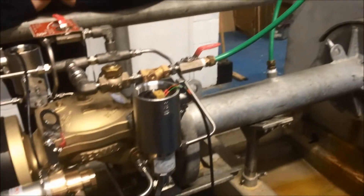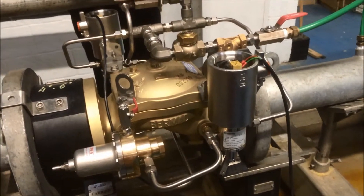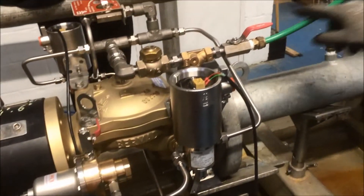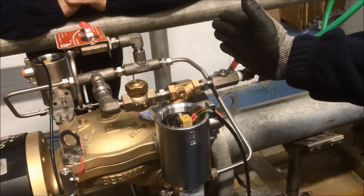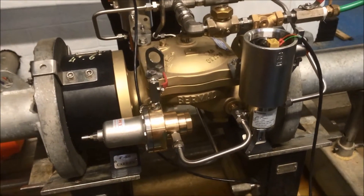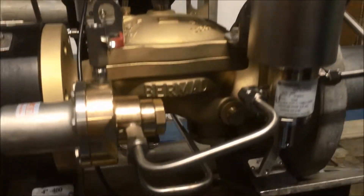All through this procedure what we've been looking for is to make sure there's no leaks on any of the pipework and that everything's working OK. I'm not worried about a drip here because this is our connecting pipework, so it's got nothing to do with the actual valve operation. We always get a few drips on the flanges, so we're not too worried about that. We're looking for leaks here and it's all clear.